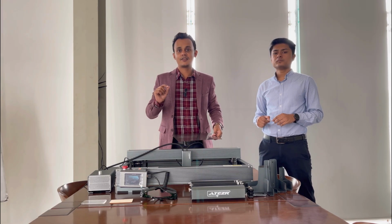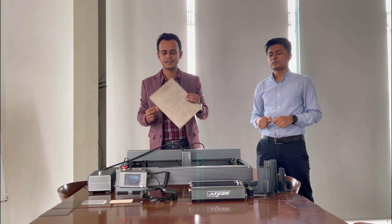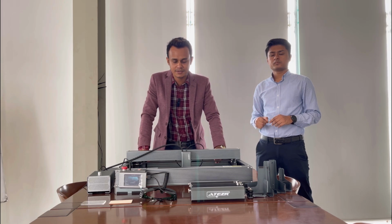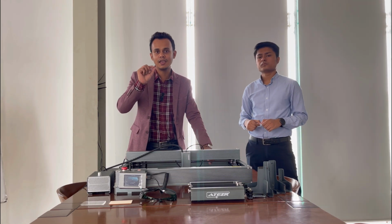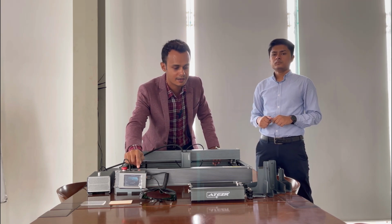If you are a laser engraving enthusiast, the initial package comes with a bed sheet of stainless steel. The initial package doesn't have a honeycomb bed, which is available at a premium price, I guess. But for most engraving work, if you have the air assist kit, you don't really need a honeycomb laser bed or magnetic bed. One thing I would like to focus on is that you can either operate this machine with the cable it comes with, or you can operate it through Wi-Fi. But bear in mind, if you need to use Wi-Fi, you need an NFC card here.